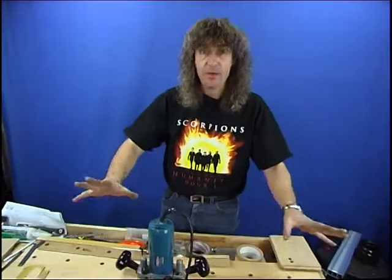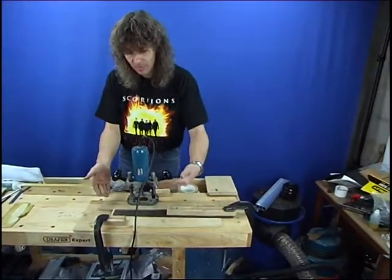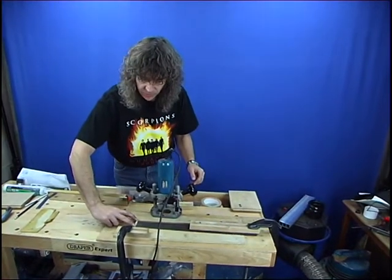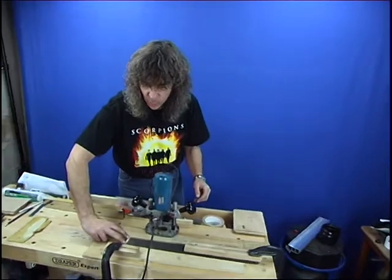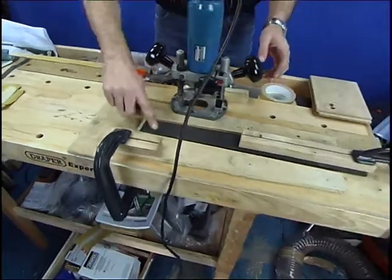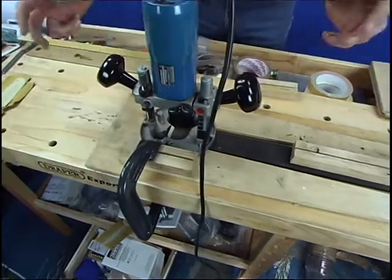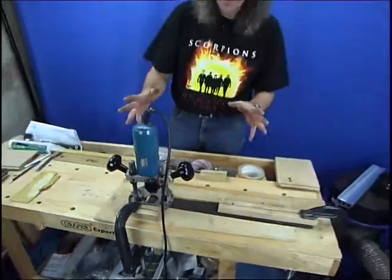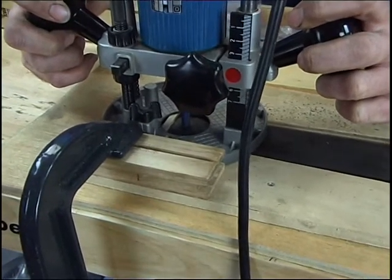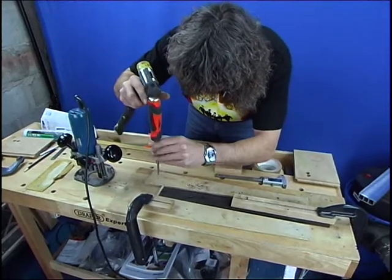I've set up the jig here. The first thing I've done is clamp the fretboard at this end, which makes the fretboard spring up a little bit. So at this end I've created a small piece of wood that fits into the guide quite tightly, just to hold the end of the fretboard down and stop it springing up. I've got a guide here to guide the router cut, and I've set my depth of cut to about half a millimeter. I'll make a pass to cut this slot and then finish it off with a hand chisel to square the edges up, so it looks nice and neat.